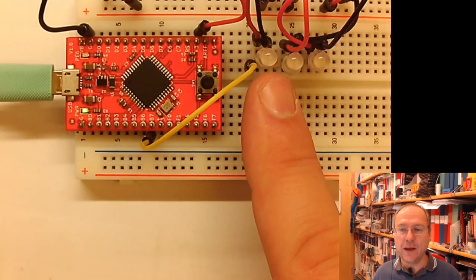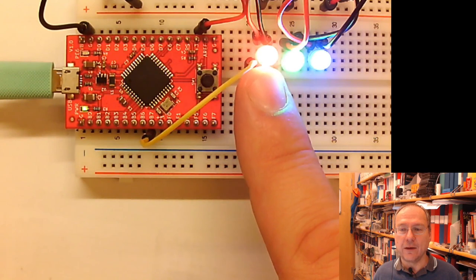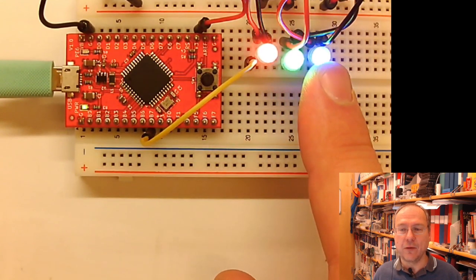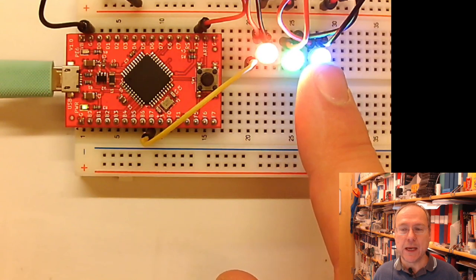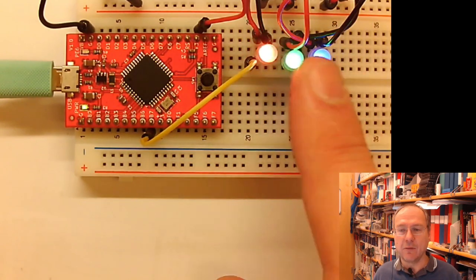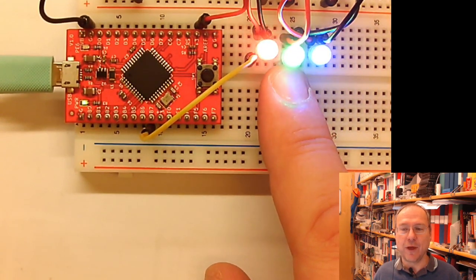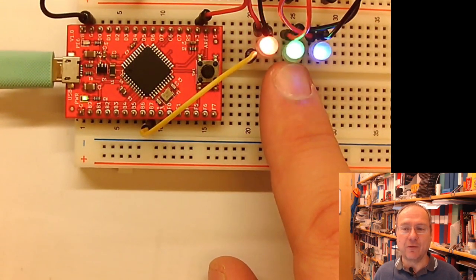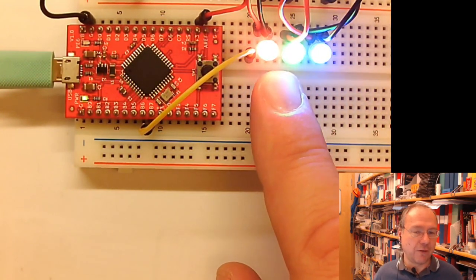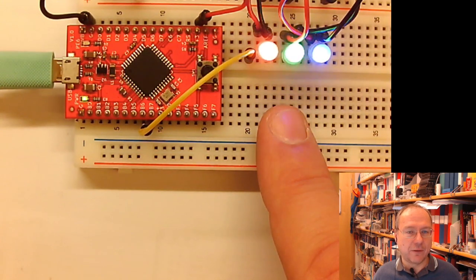What you can also see is that actually these particular LEDs are wired up so that the first byte which we send is red, the second byte which we send is green, and the third one is blue, as in RGB. Many of the LED strips and many of these LEDs have actually the colors mounted in a different order. So depending on which one of these you get when you control them, you might have to change which color information is red, green, and blue for the individual neopixels, because that's defined by the actual manufacturer of the LED, not by the chip itself. The chip can be used with any of these configurations.